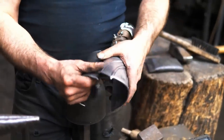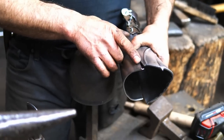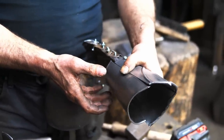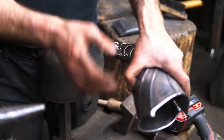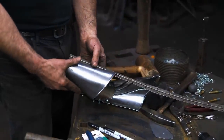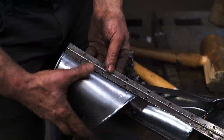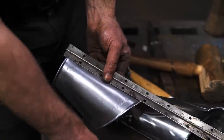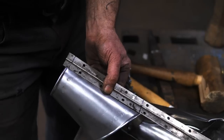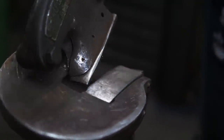Pretty much there with a little more fine tuning and then we will hinge this together. I was flirting with the idea of a leather hinge but I think I'm just going to throw a piano hinge on here to get a nice straight seam across — fairly quick and easy, not historically accurate by any stretch, but it would nicely close in this outer side. This is what's called a piano hinge, a continuous hinge I guess would be the technical term. I'm just going to trim it off to the right length, equalizing the holes as I go, then over to the Beverly shear.